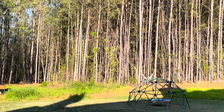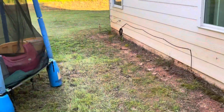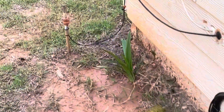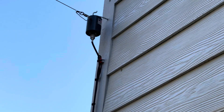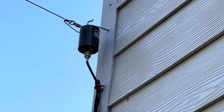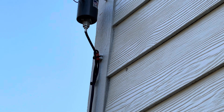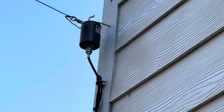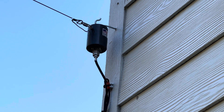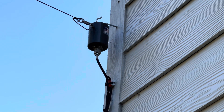Let's go back in and take a look at the SWRs. I also have an 8-foot grounding rod right here at the base of the antenna, and I have a ground wire run up to the matching device, but I do not have it connected. The SWRs are much, much better with it left unterminated. So it's literally just the RG-8 coax — probably about 20 feet of it — terminated to the matching device. That's it.